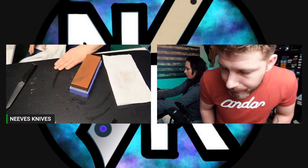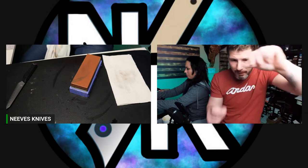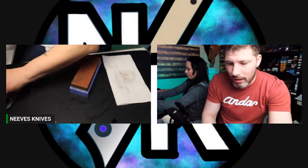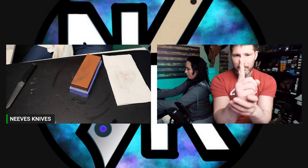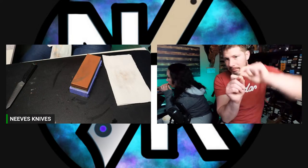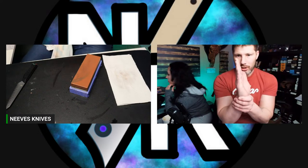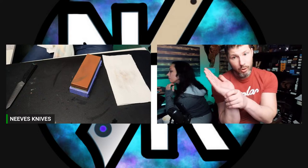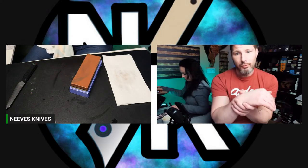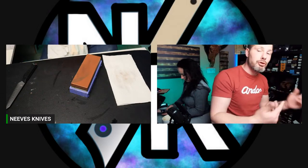Think about a burr like a paper clip. Say you unfold it and you just have the paper clip wire. Now, what if you wanted to break it in half? You'd bend the paper clip and bend it back, bend it back, bend it back until bang, it'd pop apart. Same thing with the burr. You're going to fold it over one way, then the other way. Hopefully right then it'll snap off, but in most cases it does not. You have to fold it over and over and over, and then bam, it'll pop off. Then you want to clean it up with the strop.